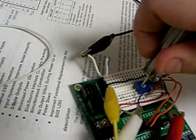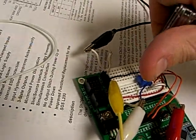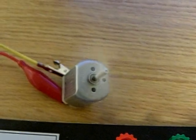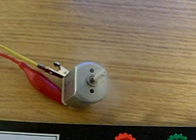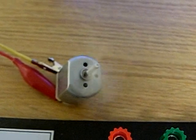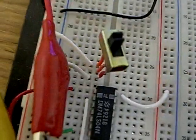To take it back down again, hopefully you can hear it. Now we're going to change the direction — you just saw it there, change it again, and change it again. That's just implemented by this switch, and that switch just changes the input to the NOT gate.